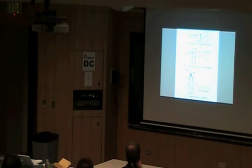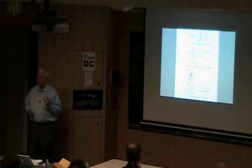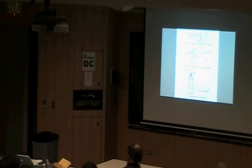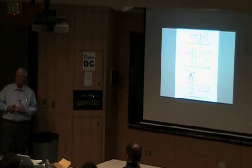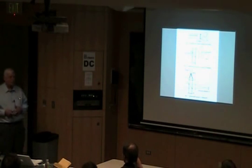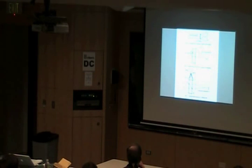Now, if you're going to test a freeform molded part, and you're going to use a hologram and an interferometer, there are a few different ways to make the hologram. The obvious way is you make the best part you know how to make, set it in an interferometer, and expose a hologram from it, and then compare other work with that. Okay, but maybe it's not that good. Another thing you could do is computer generate the hologram, which we calculated would take an awful lot of printer time in those days to produce. But he thought of a third way, got a patent on it. The third way is you take the hologram of the mold cavity, which of course is backwards.